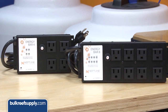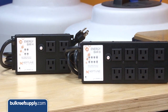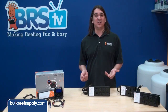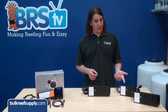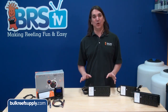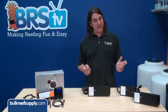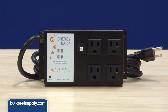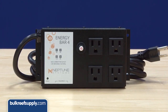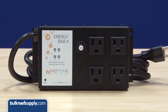Lastly, you can pick up a second or third energy bar. They come in four and eight outlet blocks. For the most part this is just a cost-per-outlet calculation. The energy bar eight is twenty dollars an outlet and the energy bar four is thirty dollars an outlet. If you absolutely know you will never need more than four outlets then the four is a good choice; if you are not sure then the eight is the right choice. The only other difference is the four has four outlets all running relays rather than triacs, which means they click and can handle high or low energy-consuming products better.